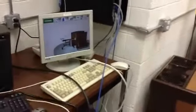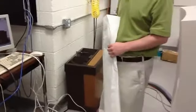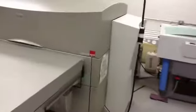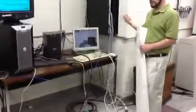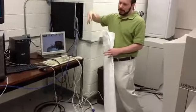It's an external drum. It's a 2540 resolution, not a 2400 resolution, which is millimeters instead of inches, basically. Once the plate travels onto the drum, the vacuum starts and the clamping system starts. So it's clamped around the drum.